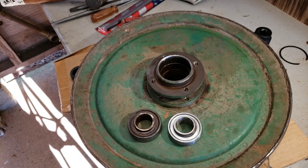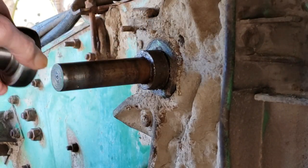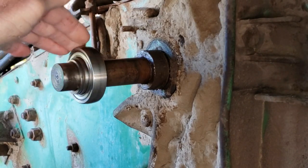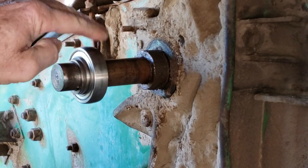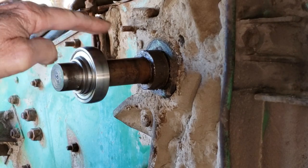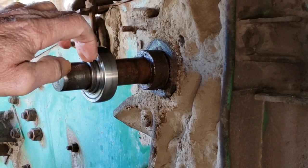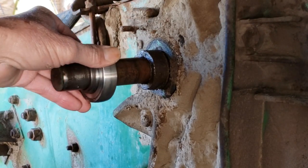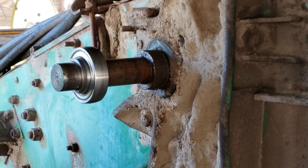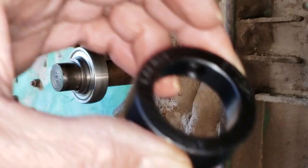I think I can give you a demo on how that locking collar works though. We can go up to the shaft back on the combine and take a look at that. What I'm going to show you is when you take this bearing and slide it on that shaft like that. When you turn it, you see how the inside race is turning right there. I've got my finger on the outside race and the inside race is what's turning.